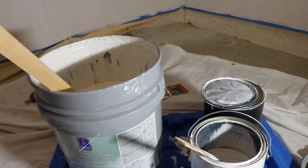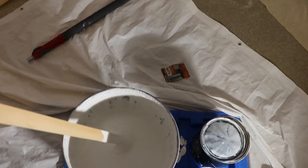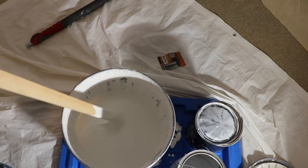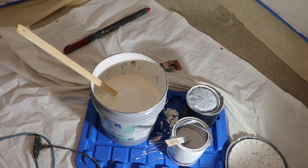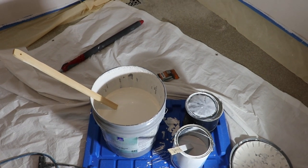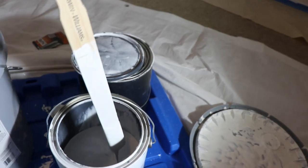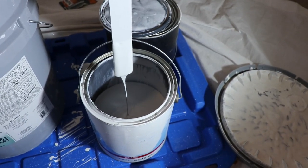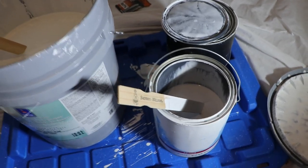The Sherwin-Williams is not paint — it's really gross stuff, more like white glue. It says you can roll it with a 3/8 nap but half the time the roller is just skidding around the room. The Benjamin Moore actually drips kind of like paint. They're both latex, but the difference in feel is significant.